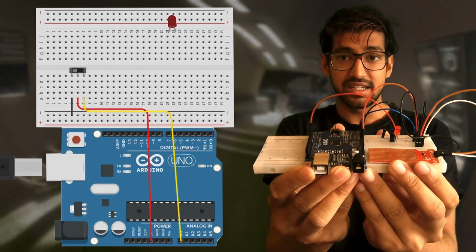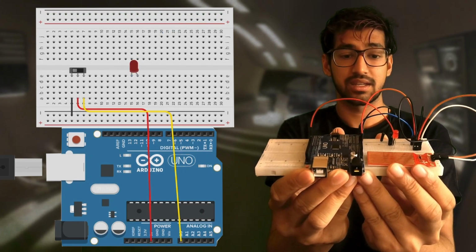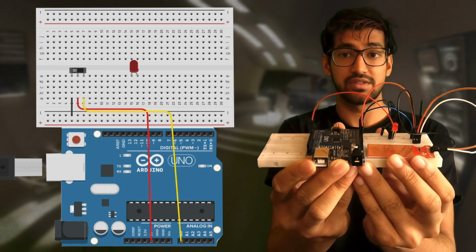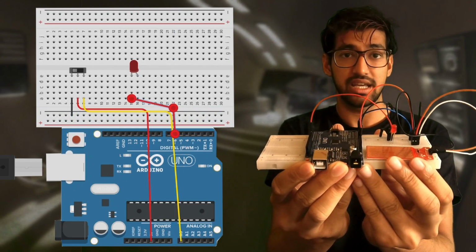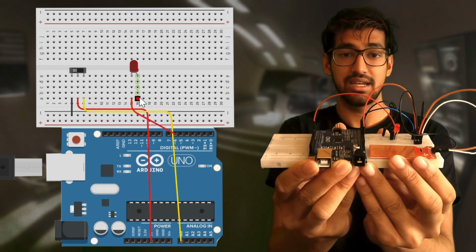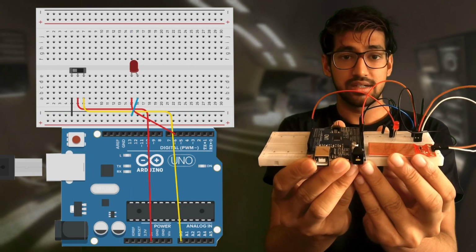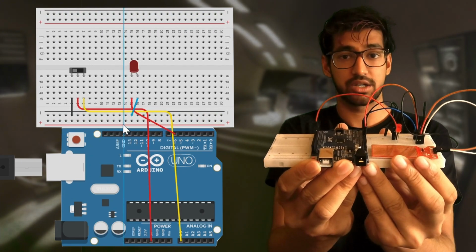The red LED goes to the pins 15E and 16E. 15E is connected to the positive terminal of the red LED. Connect a red wire from 15A to the port 6 on the microcontroller. Connect a blue wire from 16A to the negative on the breadboard. Connect a black wire connecting the negative of the breadboard to the ground on the microcontroller.